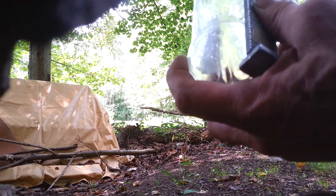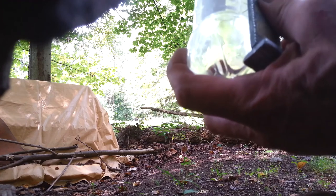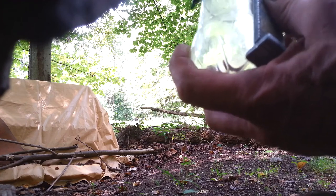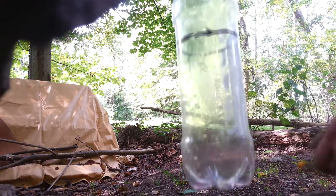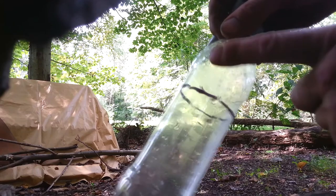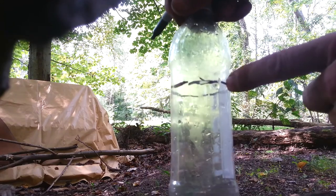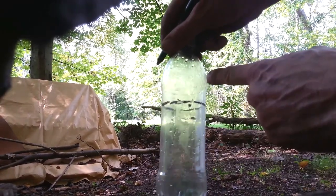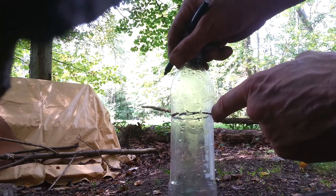Once we're able to connect the dots, I'm going to fill it with water and I will have a level line around the whole thing because water seeks its own level. I'll put the water in there and when it's out of level the water will be opposite, and when it's straight the water will be level. This is equal to this — hold this out a little further — this is equal to this, so if I lay it from here to here, that becomes my level.